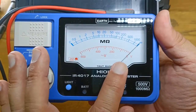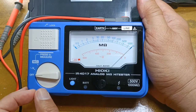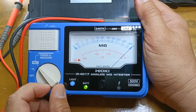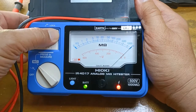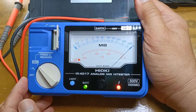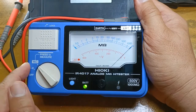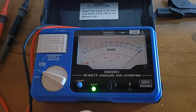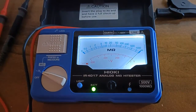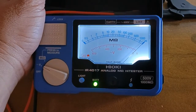To make an insulation resistance reading, turn the selector to the 500 volts insulation test range and press the measure key. You can also lock the key by flipping it up, so you can take measurements one after the other without having to keep pressing it. If you work in dim locations, you will appreciate the panel lighting — hit the light button and watch the analog panel brighten up and become luminous, making the values much easier to read.